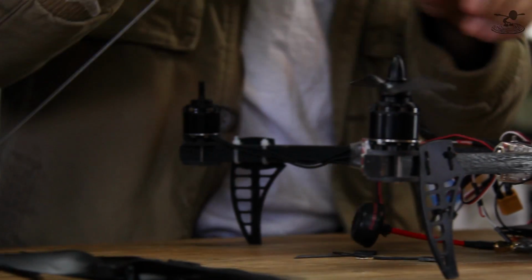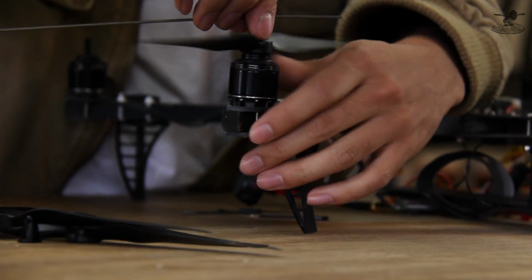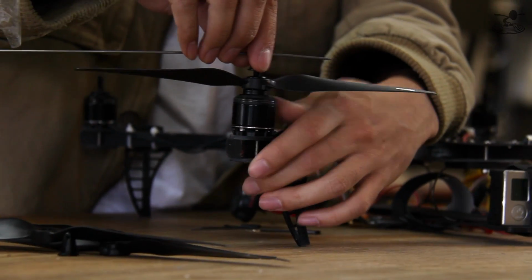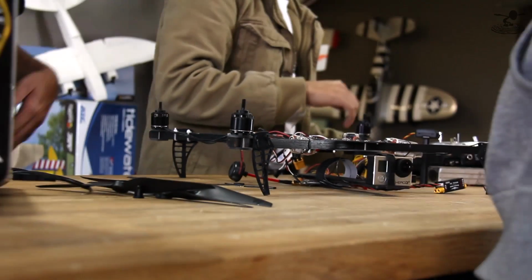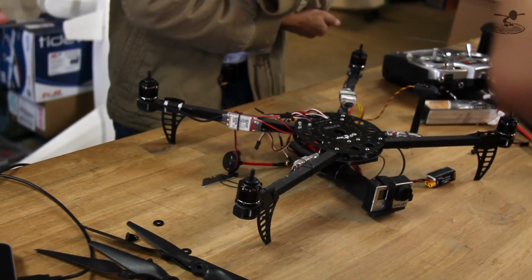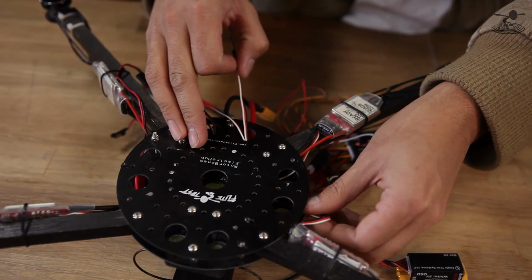Now, if you guys are wondering, there are a lot of key things with setting multi-rotors up properly. One thing is you want very little vibration. We've got lots of videos that we can link below on how to remove vibration from your multi-rotors. Don't ever neglect this step. The less vibration you have, the better your video quality is going to be, and the better your board is going to work.